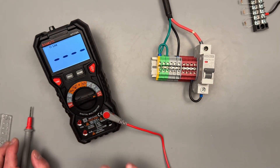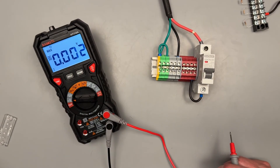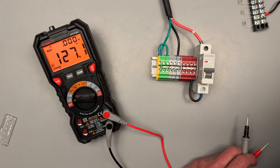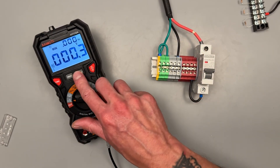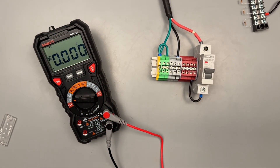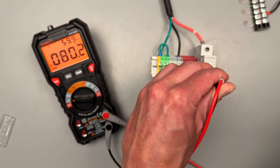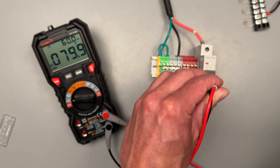Min/Max is just a store function — it lets you know the highest value achieved while measuring, and then the lowest as well. It's either one or the other displayed, but it retains both values, which is nice. I also noticed that amber warning light — I wonder what the threshold is. It looks like about 80 volts is when it lights up amber as a warning. Amber appears to be the only color it uses for that warning, right at that 80-volt threshold.